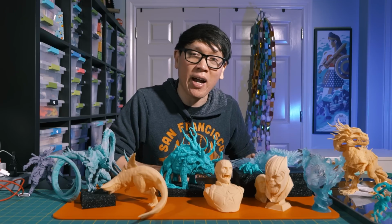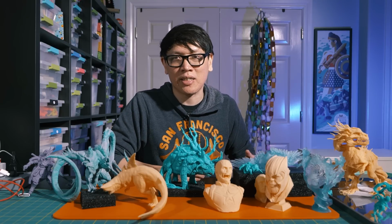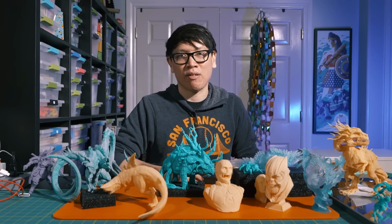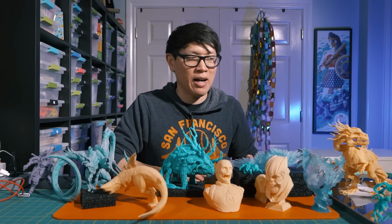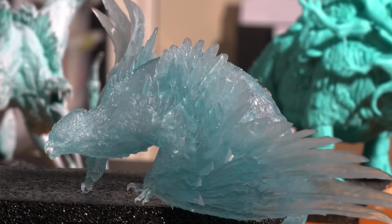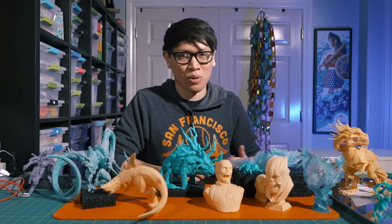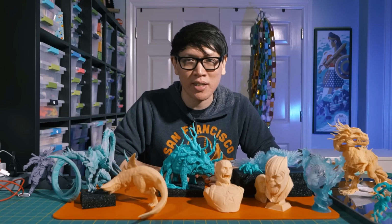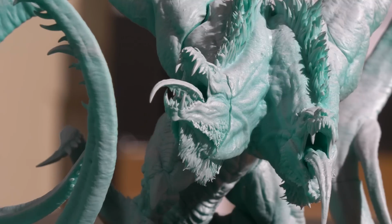But for those of you who did back that Kickstarter, hopefully this answers some of those questions. I think there are hopefully some tweaks that they are doing yet to come in their production process to overcome some of the hiccups I had with this printer. And if you're looking to buy a new printer, whether you're experienced resin printing or new to it, I would say work your way up to a printer of the Jupiter's scale. Start with one of the small or medium-sized printers first, and all the practice and training and just reps you get on those printers, from the slicing software to the processing of prints to troubleshooting failed prints, all of that will apply when working to a printer like the Jupiter.